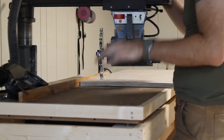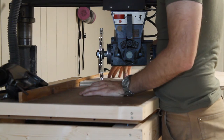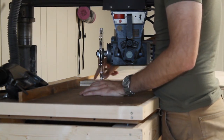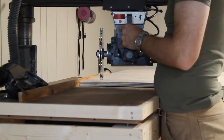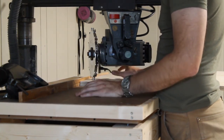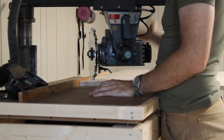So I need to orient this blade to cut a half inch away from the fence because I have my sheet goods on here — this is one of my sides. The back of this cabinet is up against the fence and the dado channel that I want to cut is a half inch in from there. So I'm going to get the blade guard back on here, get this thing lined up so that we're a half inch away, and then get the depth set so that I'm just barely kissing the plywood here. Next time I turn the camera on, I'm going to be ready to pull the trigger on this and rip this.